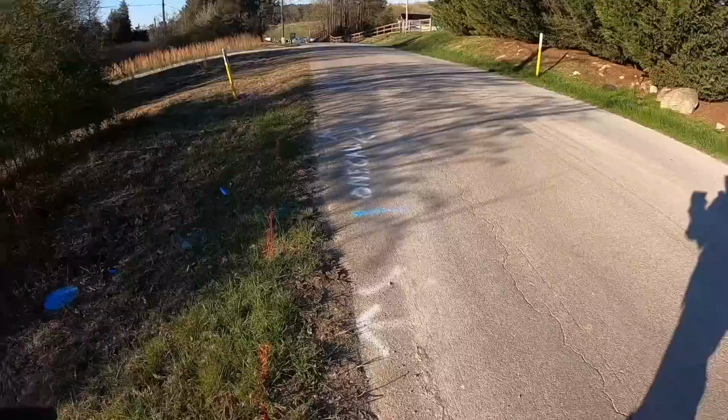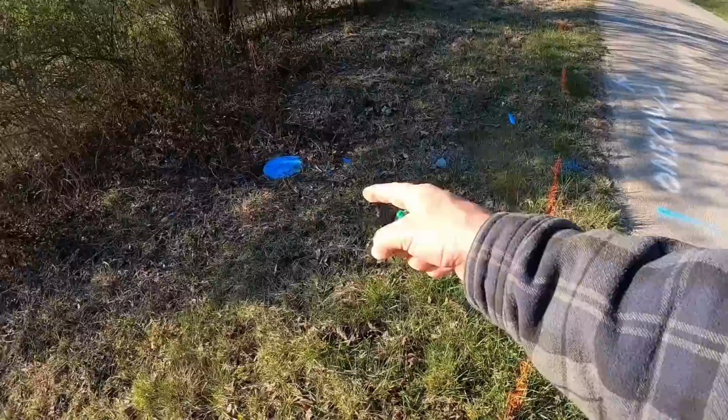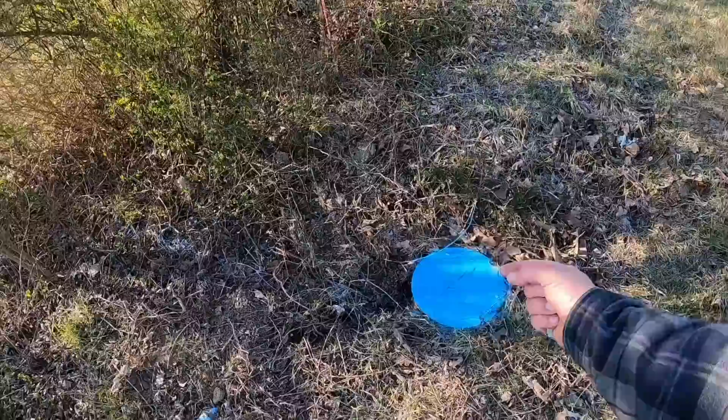Skid steer's warming up. We'll take a look up here. Called the utility locate last week, and they came out and marked the utilities that are here. So you see this orange line right here that indicates the communications line, phone lines, whatever. So it is way up here above the meter, which is fantastic. And they marked the water line coming across the road into this meter. So from this meter on, it's our responsibility.